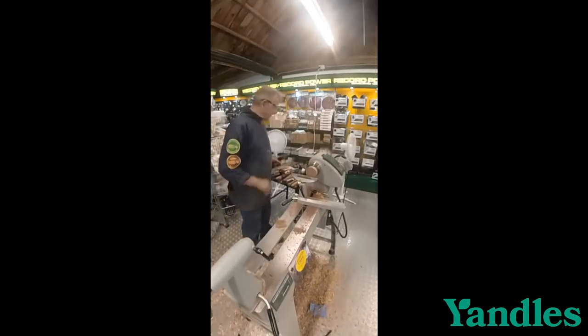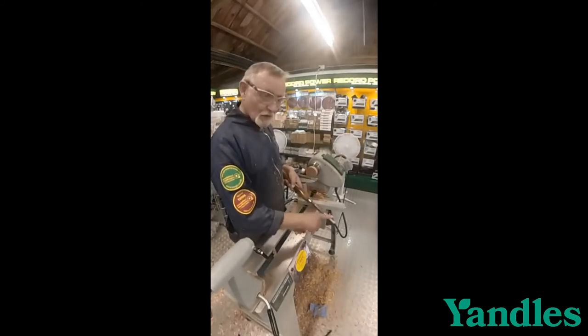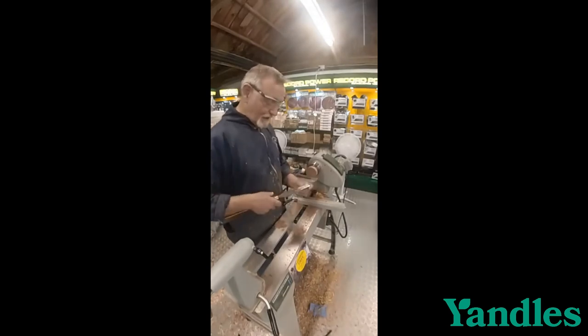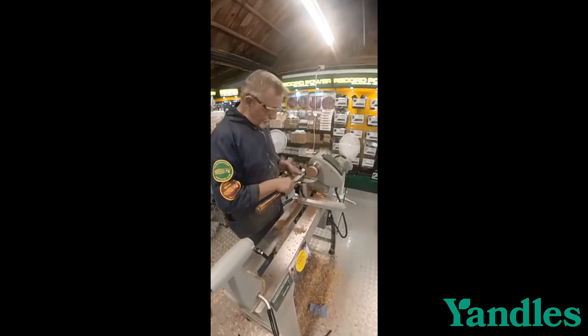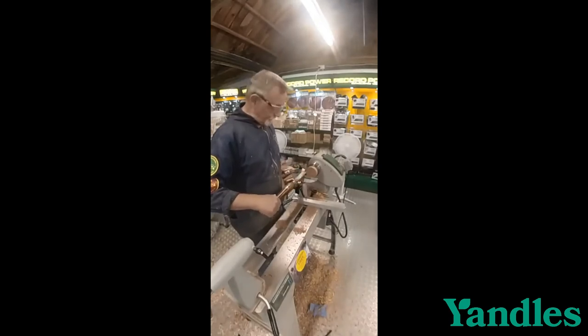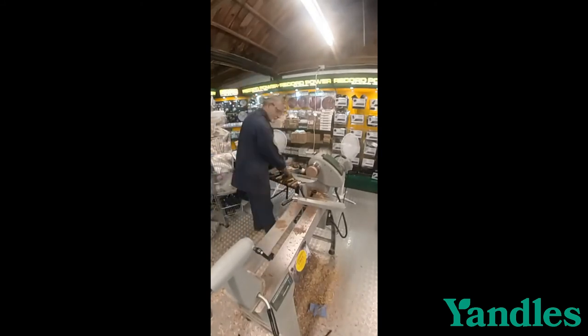Right, yeah. Okay. My scraper's got, I never sharpen this edge, but it's hollow ground. Whereas normally you use a scraper in a trailing mode, this you drop below centre, otherwise that will get in the way, and literally you just push through with a point, and you get a square edge. You can take off the squares. If it's bigger, I'd cut it into an octagon to start with, but literally, that's the fastest way I can take an edge off and turn it around.